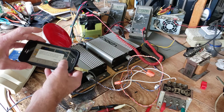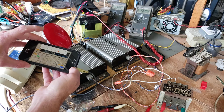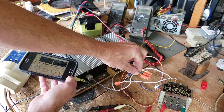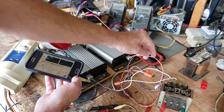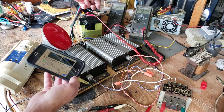To raise the voltage you just use the volume. For 20 volts each, these guys have no potential between each other because they're 180 degrees out of phase, so these two wires can act as the neutral — then you'd have your L1 and L2 for your split phase. So now I'm at 20 volts output.